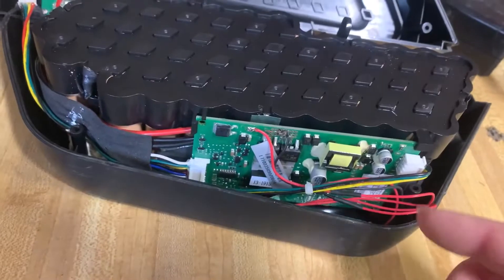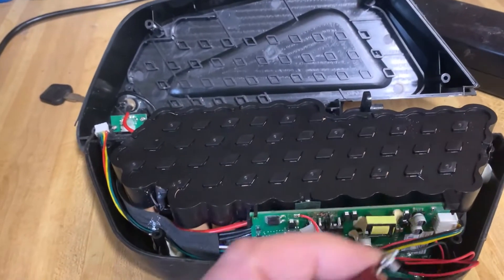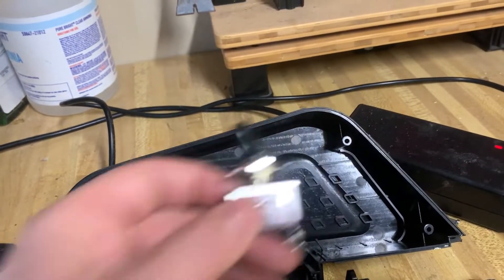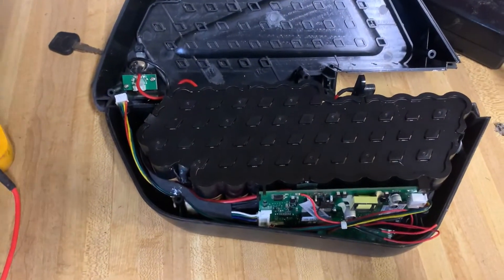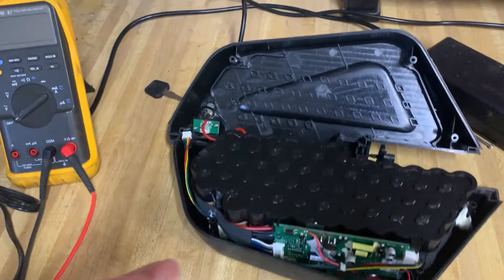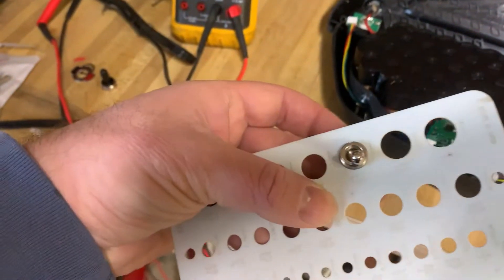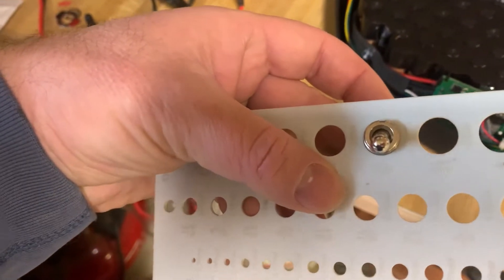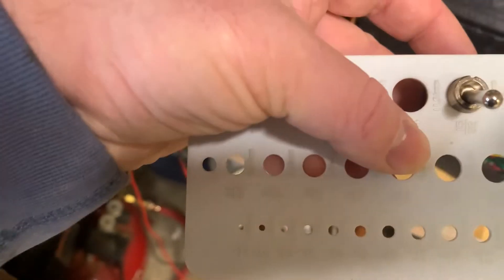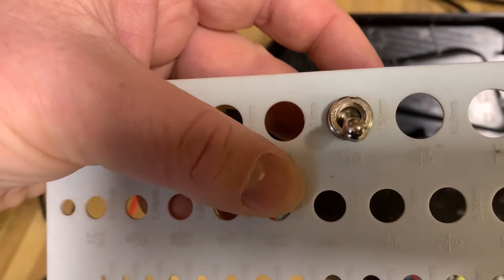What I'm going to do is cut these wires that come off the switch and attach them to this replacement switch. I'm going to drill a hole in here and bypass the built-in switch. To determine what size hole I need to drill, I have this drill gauge — I just stick the face through it until I find the right sized hole. In this case, it looks like it's 15/32 inches, and that's the drill bit I'll use to mount the switch.